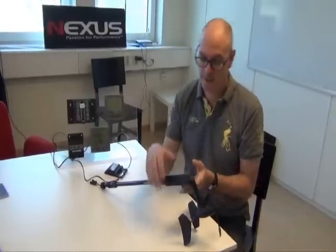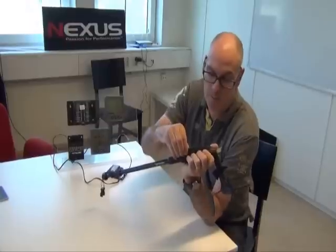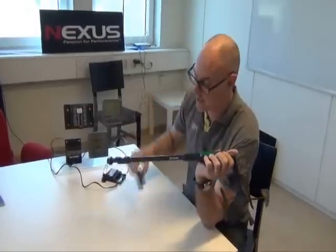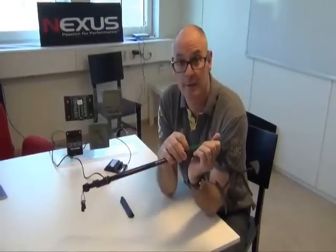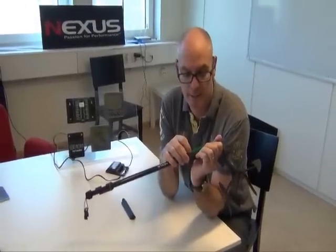So we're going to start with the wind transducer, and we need to release the pairing from the wind transducer. So what we need to do, we need to go into the battery box here. You simply take it off using a Phillips screwdriver, and you need to press the button here, and we hold that in for about 5 or 6 seconds until the light goes off.